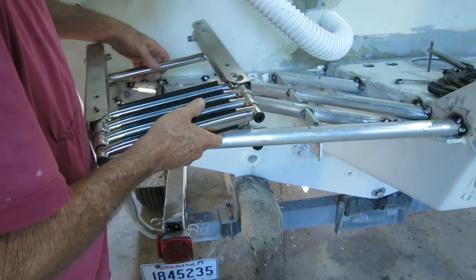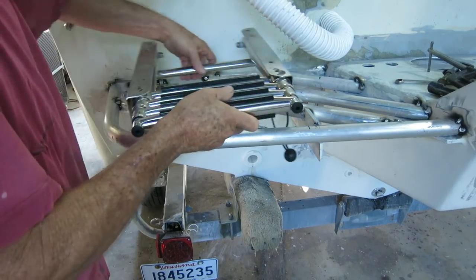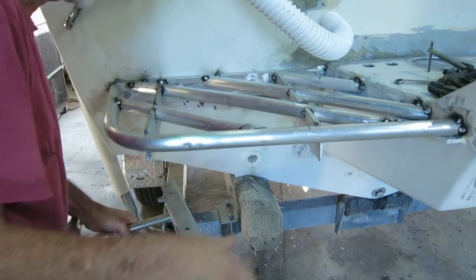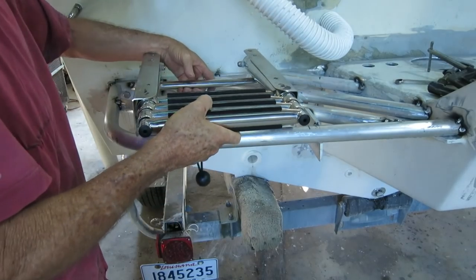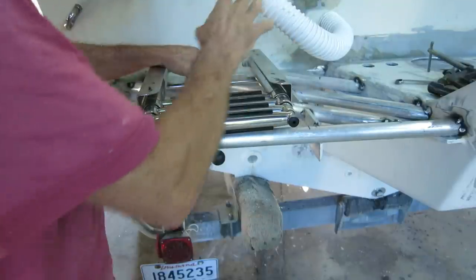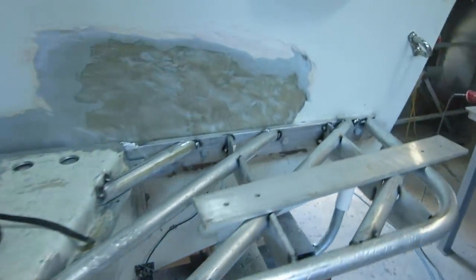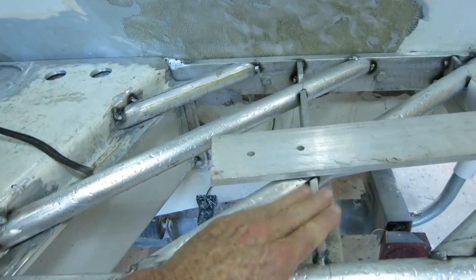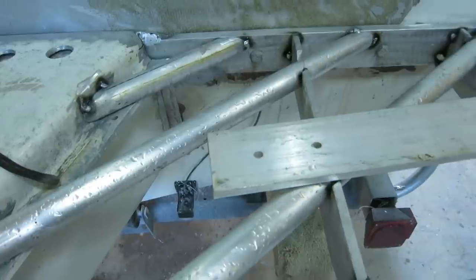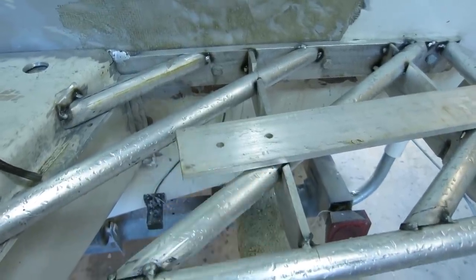I just put my last cantilever brace and I spread it out enough to get the swim ladder to fit between these two. I couldn't get it snug because I have to leave room to get the bolt out, but at least I have room to get in there. In hindsight though, I'm thinking the ladder ought to go on the other side — the battery is over here so it's already got more weight on this side, and there's a hose right here that people would be tempted to grab trying to get out of the water. So I'm going to cut this one out, take it off, and move it over. I'll kick myself if I don't spend the 45 minutes redoing it now.